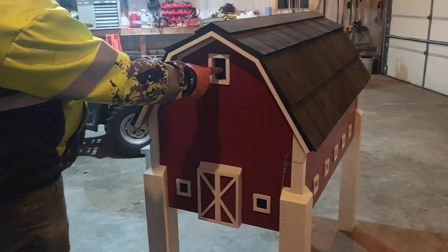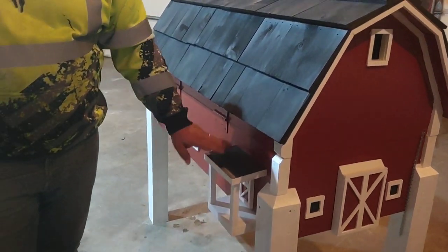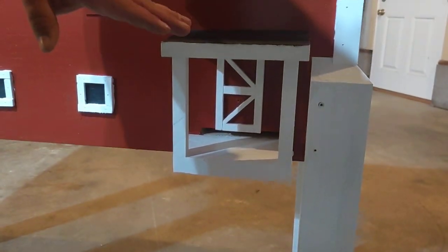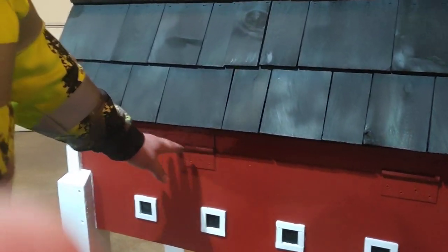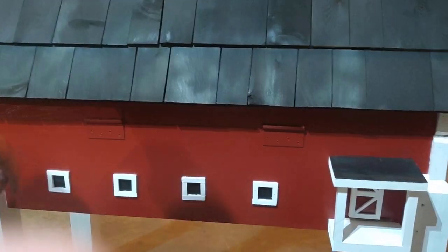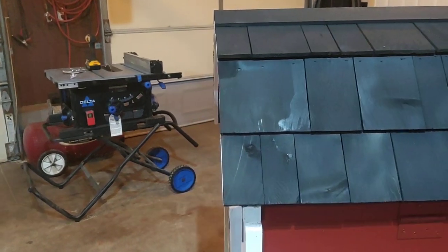The hay mow up here is the ventilation — number eight screen on it, just painted it black to make it kind of blend and fade away. This side I got the landing porch with a roof, basically just used a two-by-six, brought it up four inches, then put a five-degree slope cut to it with the table saw. Everything kind of matches up. This got four-inch by two-inch heavy-duty hinges. The little windows down here I just used little scrap pieces of wood, ripped them down quarter-inch by half-inch and framed them out to make the windows. The roof is cedar shakes — I gave them a little dusting of black paint. I do expect that to fade away a little bit as the weather hits it.